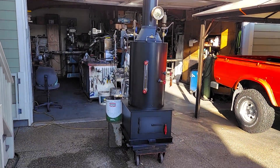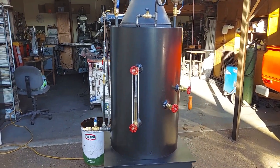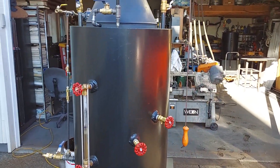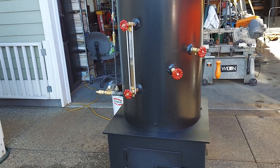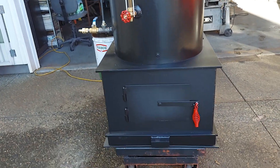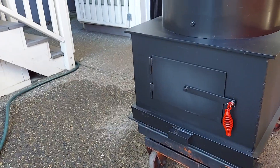Here's my next boiler: 20 inch diameter pipe, 32 inches tall, 3/8 inch thick, and it has 22 one-and-a-half inch copper tubes rolled in. The firebox is 22 square, and it's on a 24 inch frame.